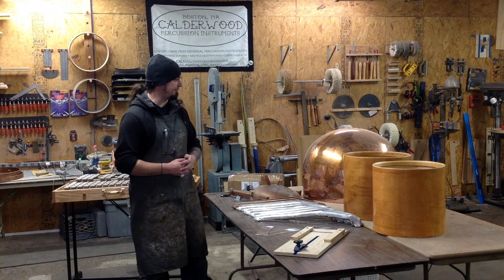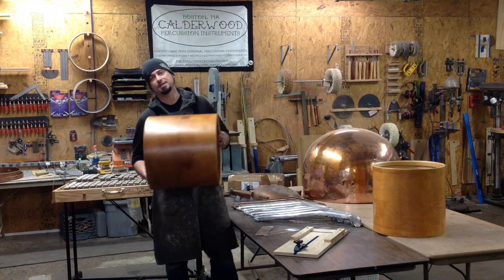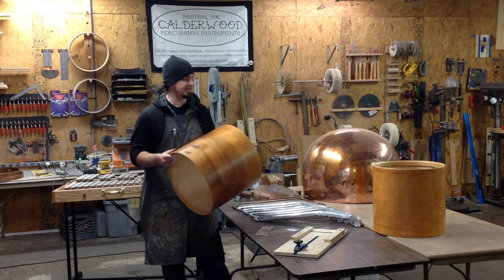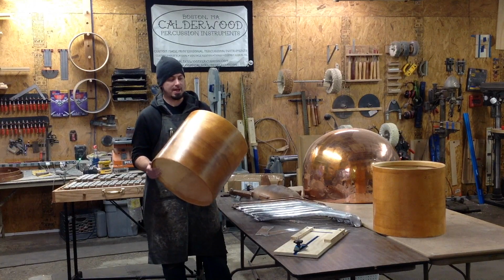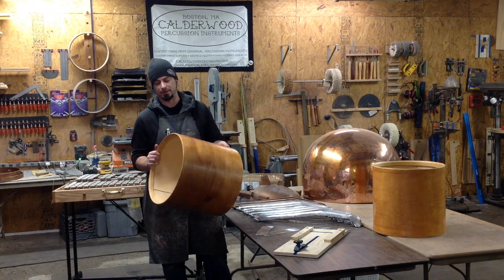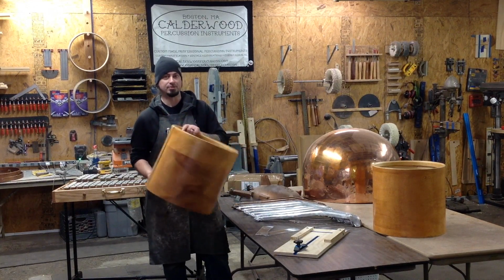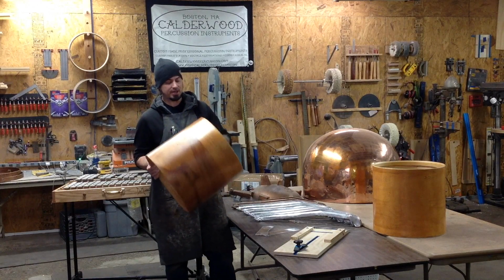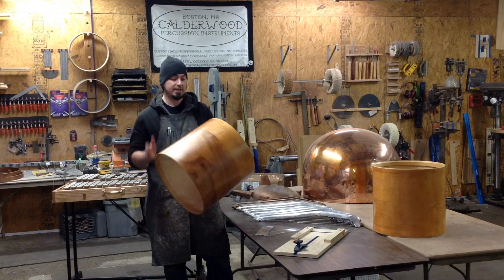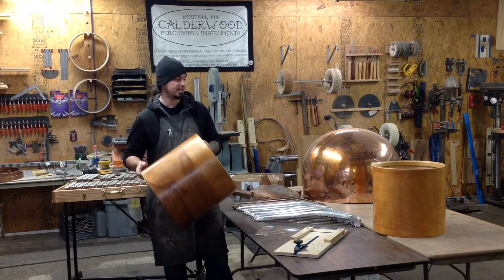Also, I think last week I showed these Eames snare drums that belong to the Piscataway Rangers Fife and Drum Corps. These drums were built in 1970 and 1972, and they needed a lot of work. The bearing edges just weren't working, and the snare beds were way too deep, and there's just no way to really make these drums sound good the way they were. So I cut off the old edges and recut them and cut new snare beds, and so these shells are ready to go. I have some work to do on the hoops, and then I can reassemble these drums.